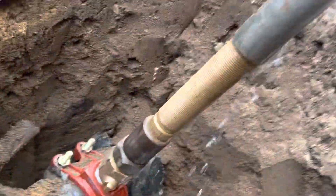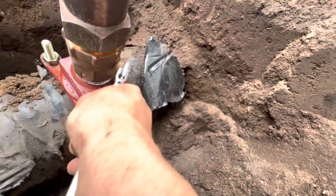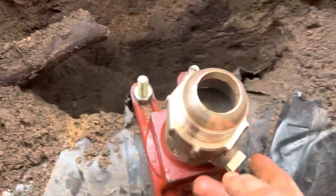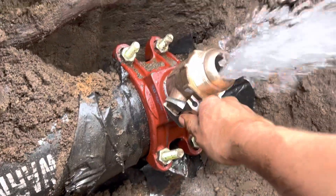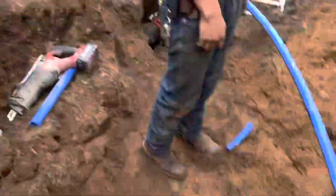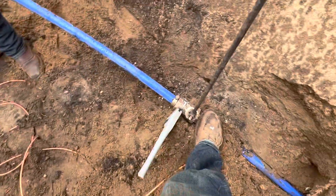We got water now. We got her drilled and he pulled a bit out past the valve — shut it up. She's good, she's not leaking. I don't see a drip coming out around there. She works good. We're good — she's on over there. It's all tight, all got lube, as tight as it can go. Got our 45 and our lube right to our curb stop.